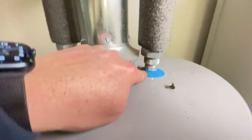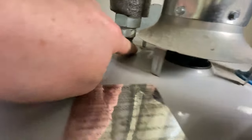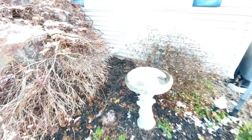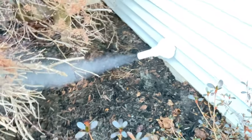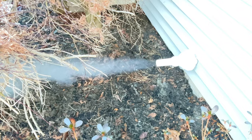Let me know how many of you guys do liners — I'm curious, different parts of the state, you know. Everything's all mortared now. I fired this up and it's not rolling out at all. But this is what was going on — it wasn't drafting properly, and you can see the rollout — it was melting, but it's drafting good now, so we're good to go. There's the vents. You can see how that accelerator pushes the exhaust — that's on high fire now. That accelerator works great on these Allied furnaces.